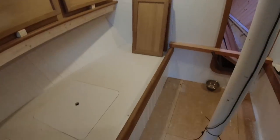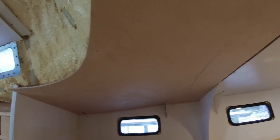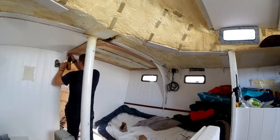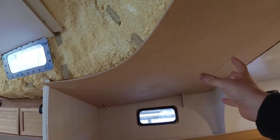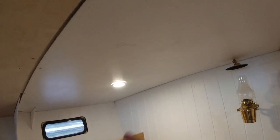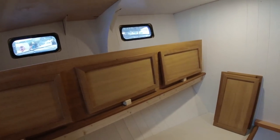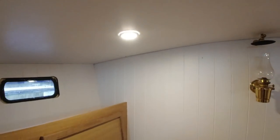While Jim's been doing the hardwood work, I've been doing the overhead paneling — which has been a massive challenge. Basically, I made a frame template out of thin templating ply, transferred it to six-millimetre birch ply, cut it out, and painted both sides. We also put in individual LED lights with their own switches. I want to go for a classical look throughout the boat — hardwood with a white background, very basic and simple but classic. The electrics are admittedly a bit plastic, but they work well and they dim for mood lighting.